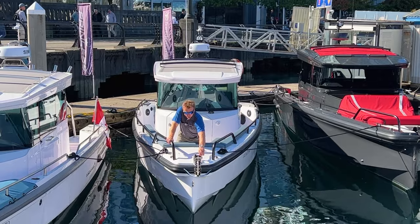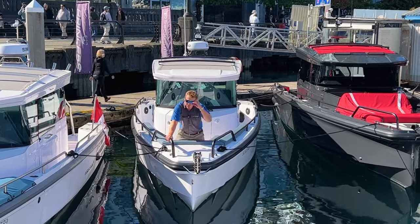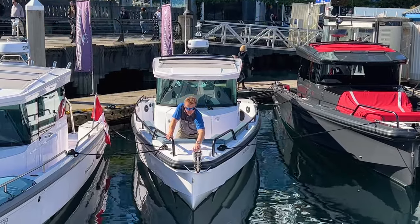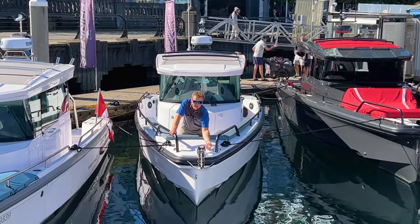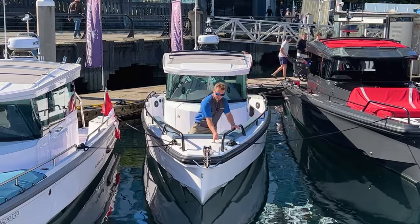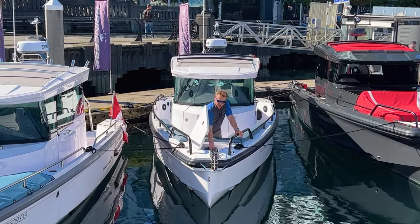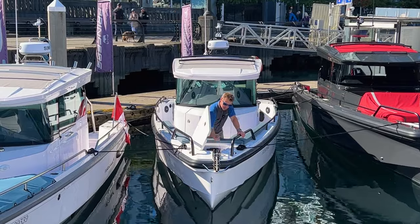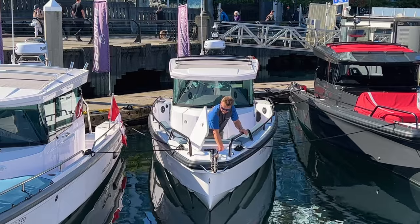Right here we have this device called the anti-rattle device. There is another full video on anchoring if you want more detail. You just unscrew each of these just a little bit — just enough to unclip it. It's captive so it will stay there. Then once you open this bow locker right here, you'll see there's a safety lanyard also attached to the chain. At that point you can disconnect it and reattach it down inside no problem.